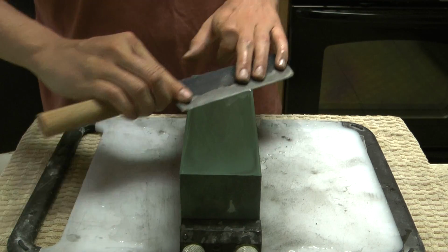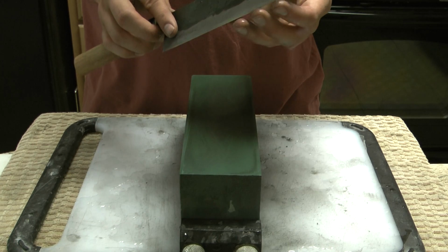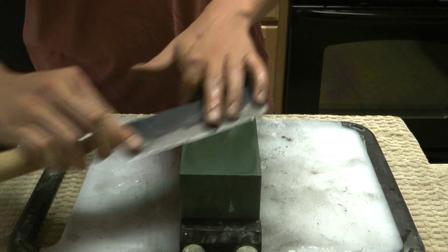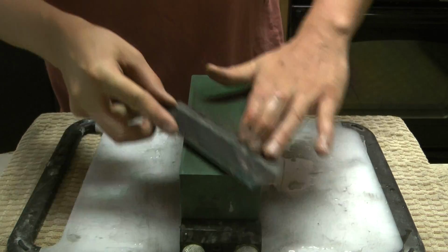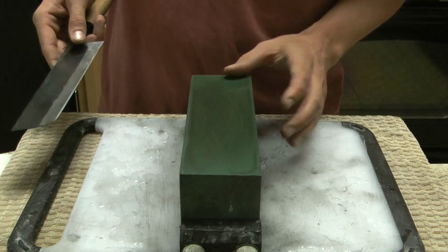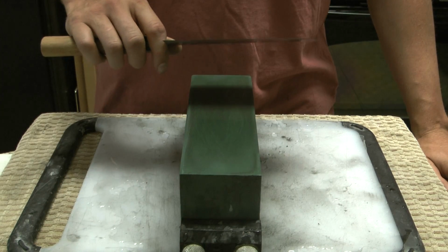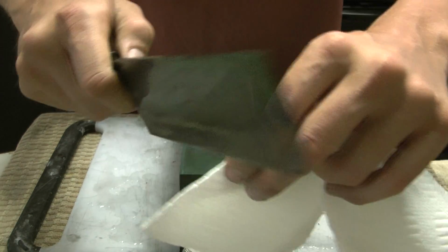I think we're probably almost done here on this stone, believe it or not. It feels at least 2,000 grit refinement. Maybe a couple more strokes here. There's a lot of shine on the bevel. This is a very abrasive, or just a rich stone. It likes to grab the scratches and just kind of erase them off your knife. We've already got a really nice bevel going.